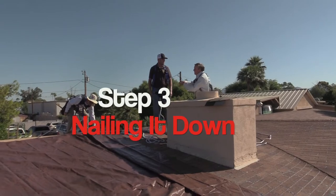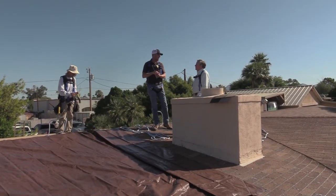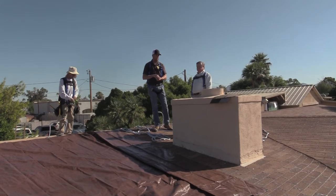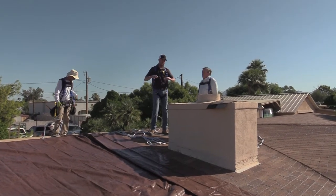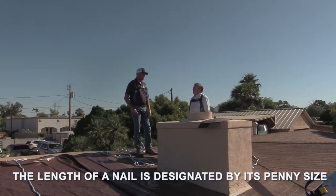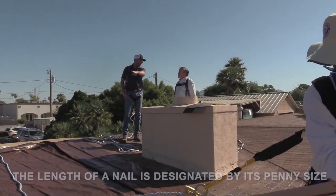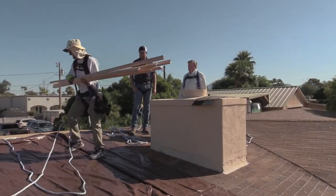So you're actually nailing this tarp to the roof — what do those nail holes do? The shingles are still pliable enough that they seal around the nail, so it's not going to be a big hole — just a nice little nail hole under the tarp. It'll be an 8 to 16 penny nail, and they'll use roofing cap nails across the front.